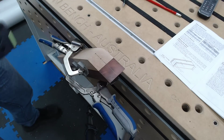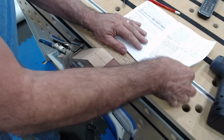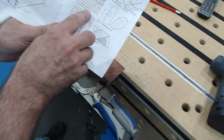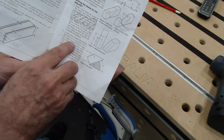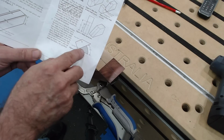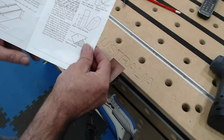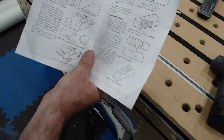But there you go. All right, now it says here to use a center punch or scratch awl to dimple the locations. Drill press is ideal for drilling the holes, as is a jig block with a 45-degree angle to hold it in position. This is their little block that they're talking about that we just cut out. One or more specifically, that you can use a turner's tape to affix blah, blah, blah. We're not doing it that way. All right, here we go.